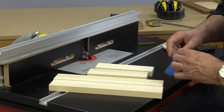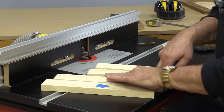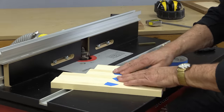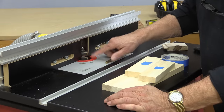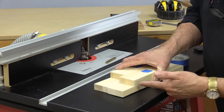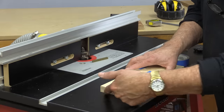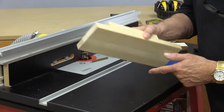Now I'm going to mark all of my wood. I like to use blue tape because it stands out and I know where it is. This is going to be the back of every component for the door, so every time I cut a piece I want to be seeing blue tape. The reason for that is when I adjust the bit, I'll know that all of the bits are keyed to the base plate — the distance between the base plate and the bit is how I'm going to measure it. This way everything will always be consistent, whether I'm making 20 doors or one door.